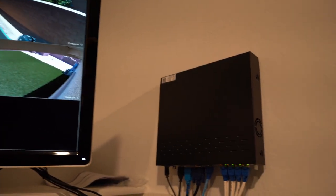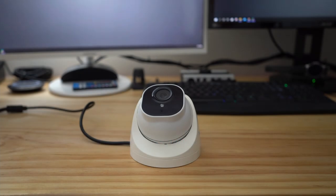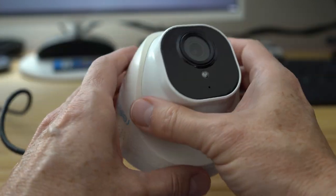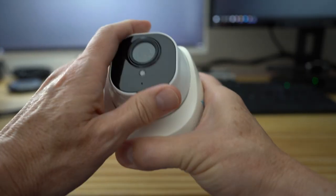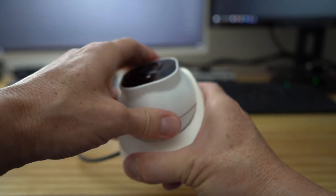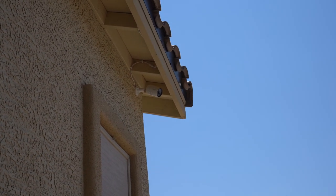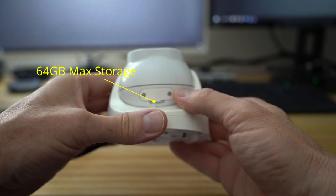Now let me give you my opinion on this Reolink turret camera, starting with what I don't like. This camera is made of plastic, which doesn't feel very durable. Even though it's rated IP66, it should still be installed under a roof line for some protection. This camera does not have two-way audio, which is pretty standard for most PoE cameras. It also does not have PTZ abilities — pan, tilt, zoom — so you'll have to manually move the camera. The 80 degree viewing angle is okay, but many cameras have a 120 degree viewing angle giving a larger viewing area. I also wish the camera cable was white or beige instead of this black cable. And the camera storage capacity has a maximum of 64 gigabytes — it would be nice if it could hold twice that amount.